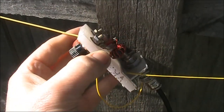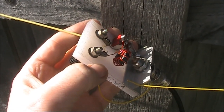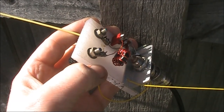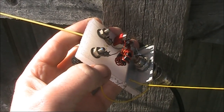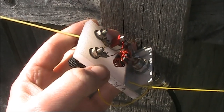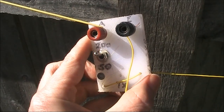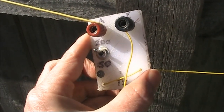What you're seeing here is a 4-to-1 balun. It's only for low power, so I've just wound it on a ferrite FT50-43. The aim of that is to transform the impedance to 50 ohms for the transceiver.